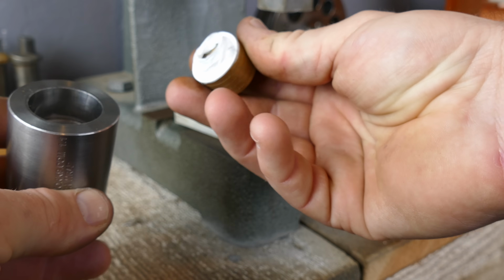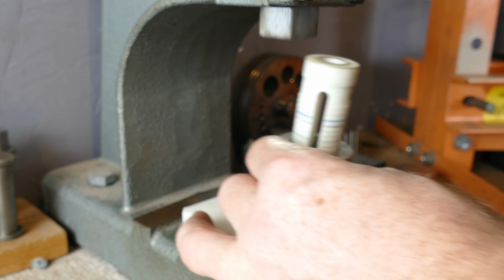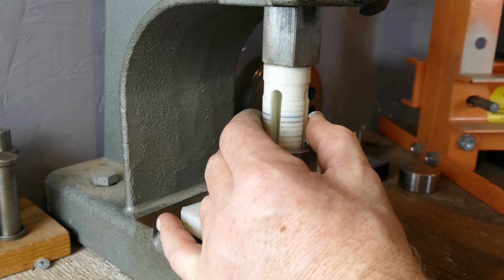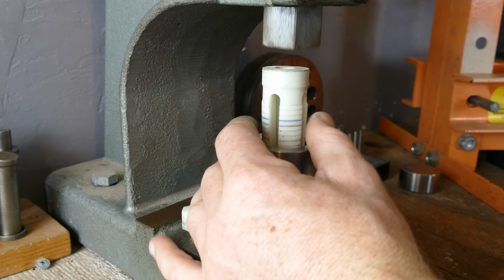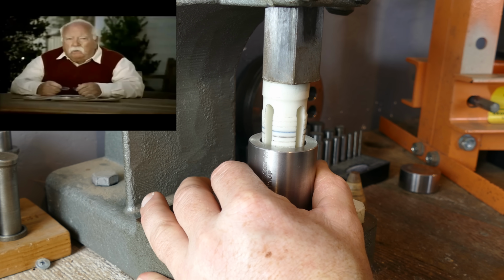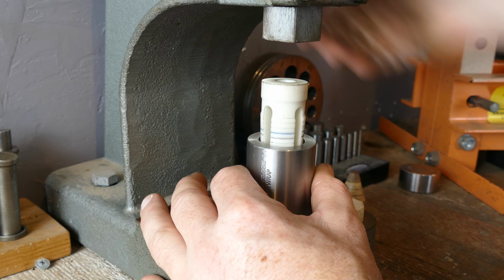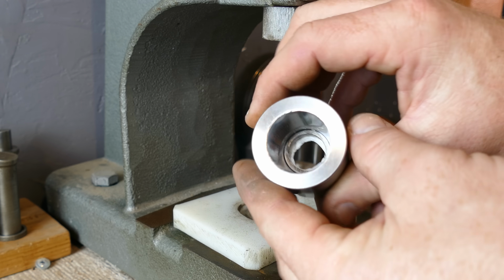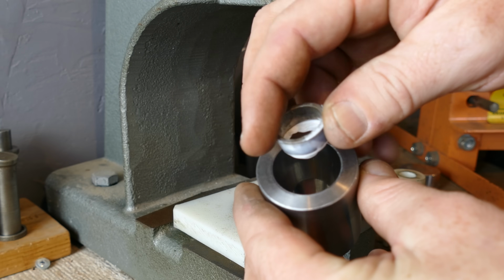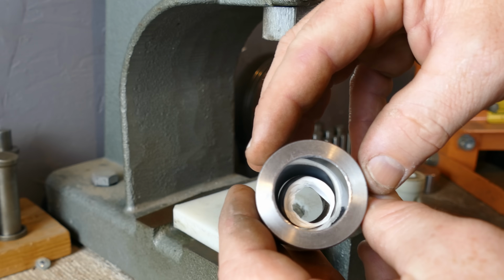And now that the brass plunger has cut the tape, we can get rid of the plunger and switch over to this Ross coin ring push follower. And this just allows us to press the coin all the way down without having to constantly switch different plunger sizes out. Mind-boggling. I've gone far enough, we're going to turn it around and get rid of any cone shape that we might have. Make it a perfectly flat, even ring.